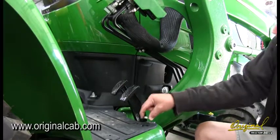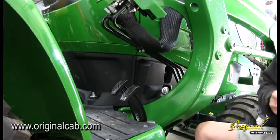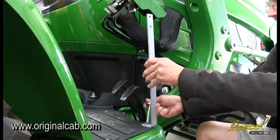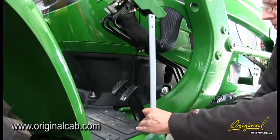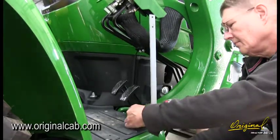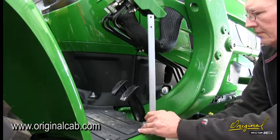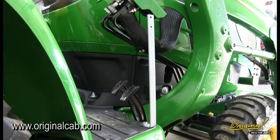Step 2: See figure 2. A. Remove the bolt and nut at reference A. Place four three-eighths flat washers over the hole. Place a foot on the step plate as shown. Place a three-eighths by one-and-a-quarter thick fender washer on the foot and insert a three-eighths by three-inch bolt down through the holes. Add the flat washers that were under the step plates and a three-eighths lock nut from the cab hardware package. Do not tighten at this time.